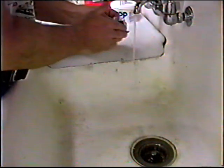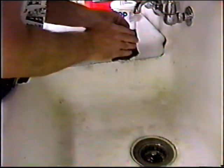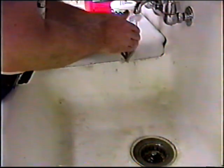Now, because we want to paint the spinners, I want to get all rough edges off and the razor edges so that the paint will stick better. This is wet and dry 320, that's 180. Nice and rough, put plenty of scratches in. I'll get a coat of Brodak primer on these, and a coat of the color paint, and maybe a coat of clear, if it ever stops raining.